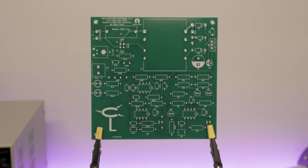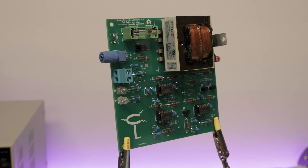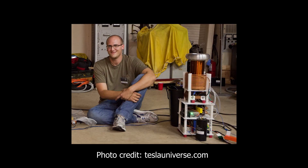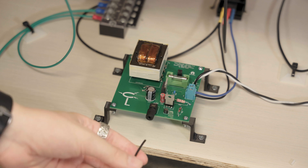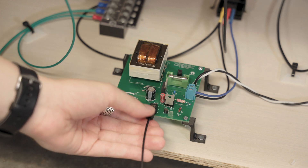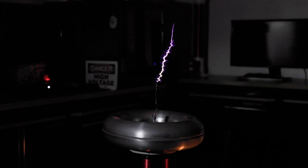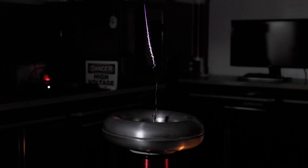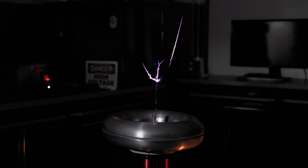The part of this Tesla coil that is working perfectly fine is the staccato interrupter. This opto staccato controller is a modified version of the original staccato controller designed by Tesla coil legend Steve Ward. I basically split the circuit into two and added a fiber optic link between the controller and the receiver, so I can adjust the interrupter frequency and the duty cycle without getting anywhere near the high voltage. Using a staccato controller with a vacuum tube coil powered by level-shifted AC can give you some really interesting effects. If you get the duty cycle right, the pulsed ramping from the level shifter creates these long, straight, sword-like sparks. If you've ever heard of a quasi-continuous wave or QCW Tesla coil — a type of solid state Tesla coil — this is a similar idea to that.